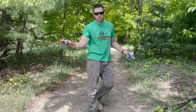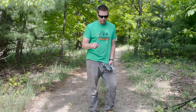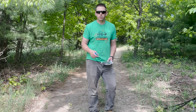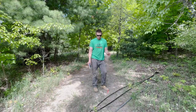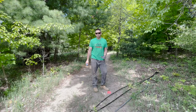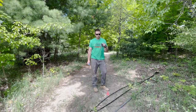We have our lines all set up here. One thing to note is that we have a flag set up because eventually we are going to bury this a few inches under the ground and put it in some pipe. That way, as we're driving across this two-track, it doesn't put pressure and potentially crack the line. The next thing we're going to do before we test everything is put in our emitters.